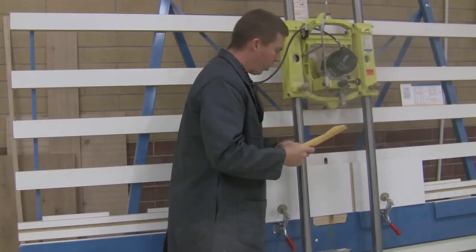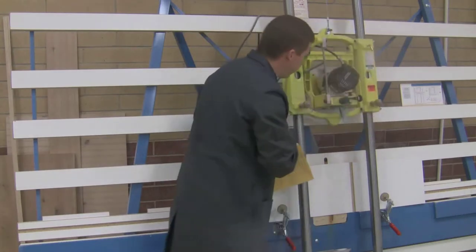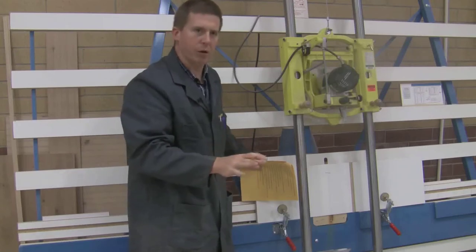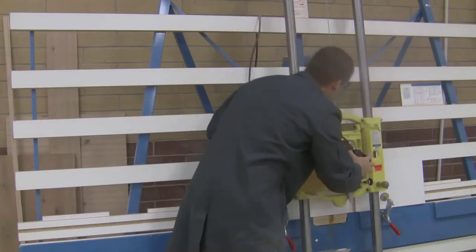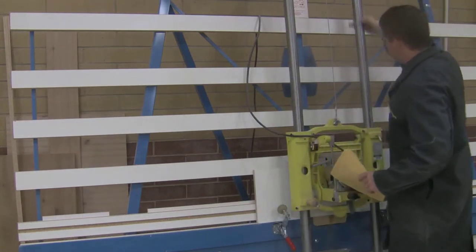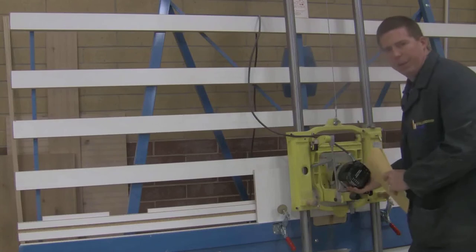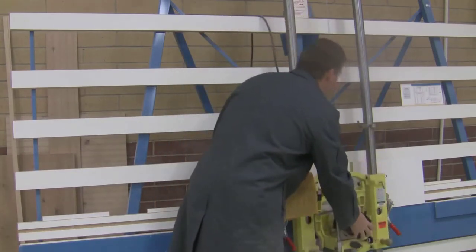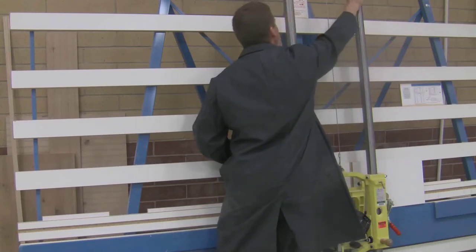For freehand cutting, make sure to mark it with both lines and that they're even. We can also make what's called a stop dado — a groove that goes all the way up and then stops about an inch or so before the edge of the board. Mark where you need to stop; I can see the tip of the bit right there. Then loosen the little bracket up here, bring it down to that mark, and tighten it back up. Now every time I cut, I will stop at that specific spot, making it repeatable. That's called a stop dado, and it's a simple piece of metal with a bolt. We don't use it often, but it's here if you need it.